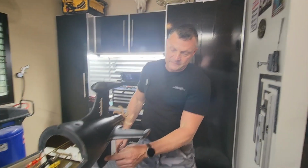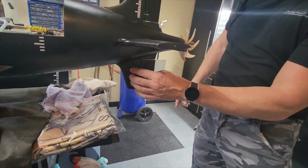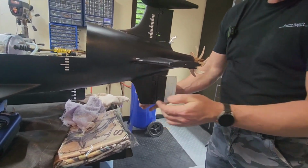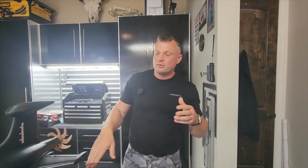What other people have done, either in addition to or in place of, they actually make this lower stabilizer, which is fixed, part of the rudder so that the entire system down here moves. I kind of like that personally because you can rig it up to make it look like it's a separate rudder. But the only time you'll see that it's not actually scale is when it's up out of the water and you're testing it. So as a hint, if you've got a modern boat with the stabilizers on the bottom, not a free-flying rudder like the Americans typically use, you can make that whole assembly your rudder, and that will basically double the surface area of the lower rudder, making it a lot easier to drive around.